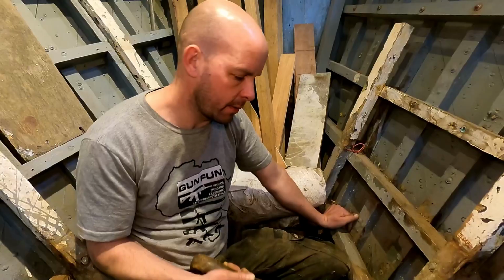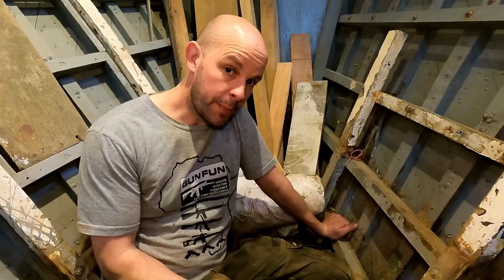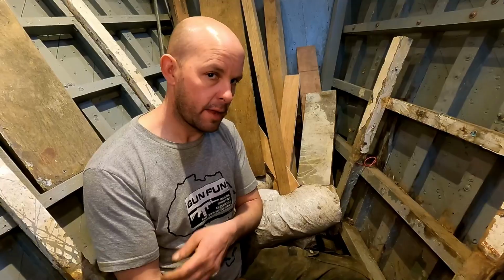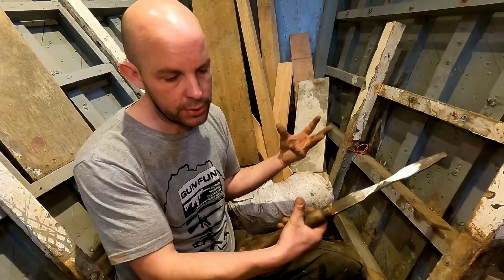It's extremely difficult to replace the stringer all the way through, so we're going to do a repair on the stringer. So I'm going to put like a noggin, what they're called. So we're going to put like a noggin in, but then we're going to sister it from the bottom. So then we're going to bolt it up through the bottom, and then maybe next week or another time, they will then go right through and then nail the sister to the hull. So, yeah.